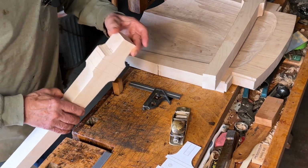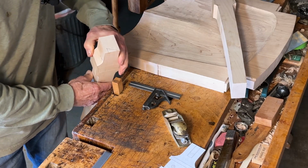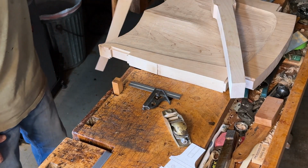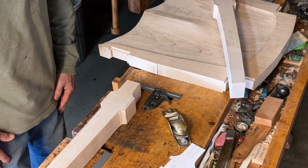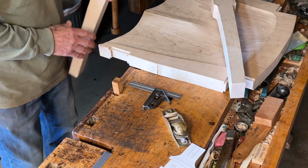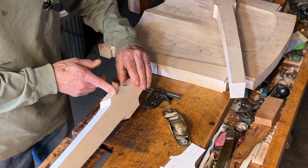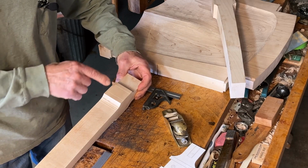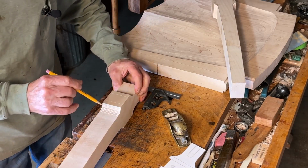By the way, I've got triangle markings on these things, so I know that this leg actually goes into the socket, the joint over on the other side. I've used it to check that same dimension over there, and it's accurate. But now I need to move this cut line over to this face and also to this face, because these also get routed out a quarter of an inch deep, and I need an accurate cut line.